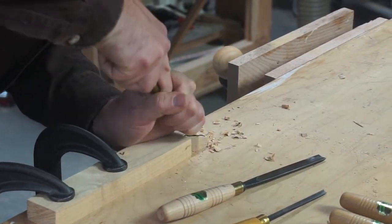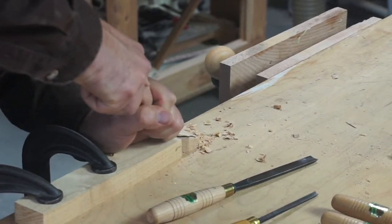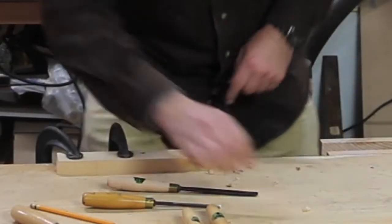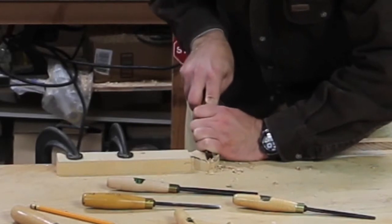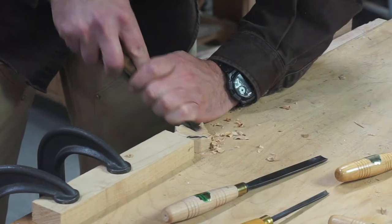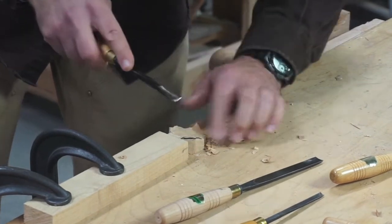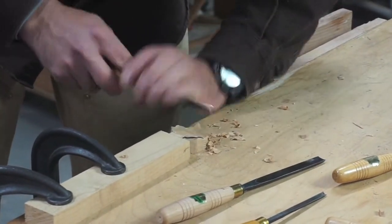And I'm not really changing the shape here so much as I'm just removing some of the tool marks left with the medium step. And I may have to go back and clean up that bottom of the bowl issue again by going across the grain. In this case I'm doing a fine operation, a surfacing operation, but I have to use a swept gouge to match the curvature of the carving.